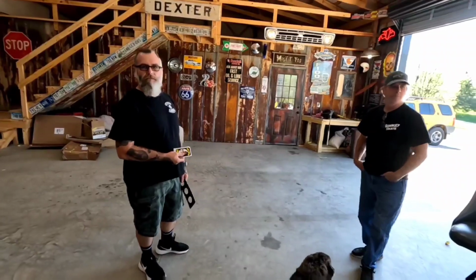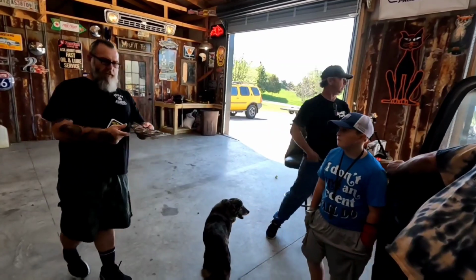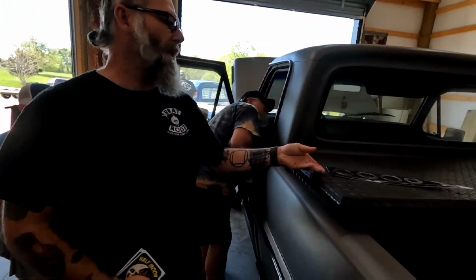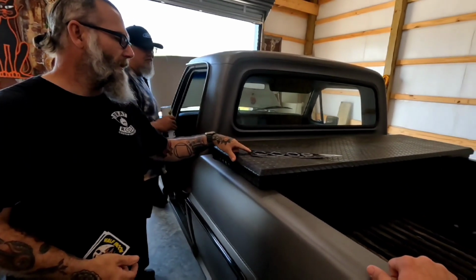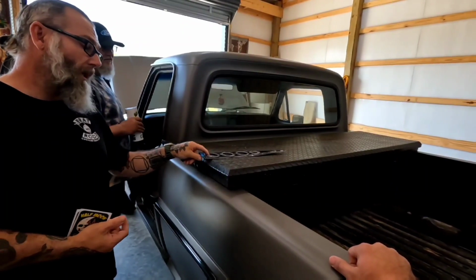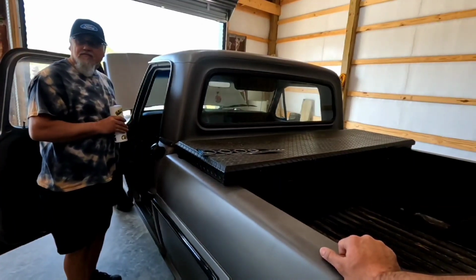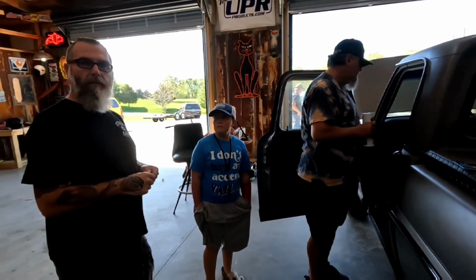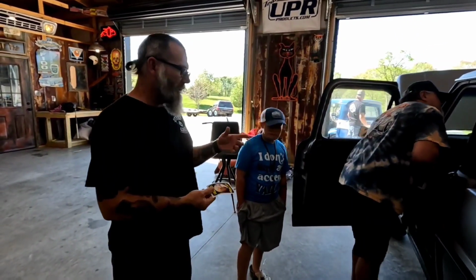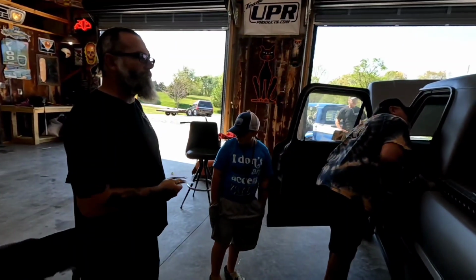I had learned about the stretching of everything. I guess you have to stretch your sheet metal. Do you do that with aluminum? If you see how flat, it's perfectly flat. I usually hand work everything that I can. Sometimes on big sheets, I'll make multiple passes. You go slow and make a couple passes and do a little bit at a time, and then you can form everything out by hand from there. Of course, it rivets on like a door panel would screw on, so it all holds up. It does kind of pull itself back straight, flat.